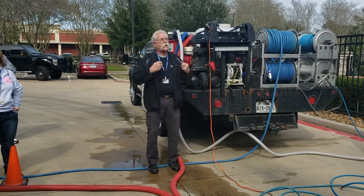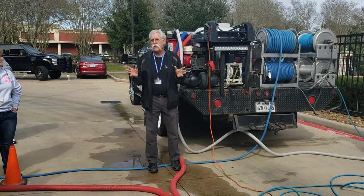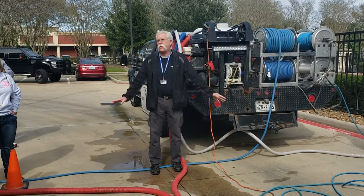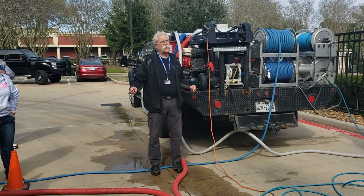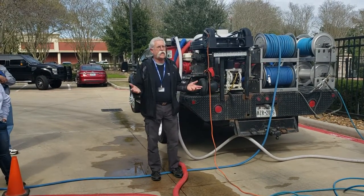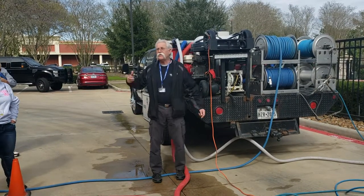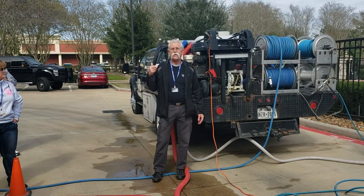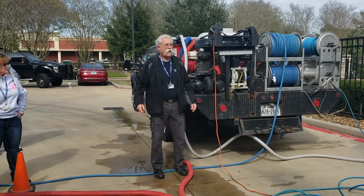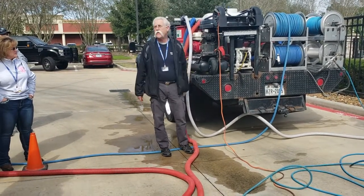The first idea is to get water sucked up. The coolest tool in the industry because of its ability to control overspray is the vacuuming surface cleaner. I've been selling vacuum reclaim systems for 28 years because of instant capture — not because there's some law enforcement guy beating the streets on you. It's because you want to control your overspray if you want to clean the front steps of city hall where people are walking by.